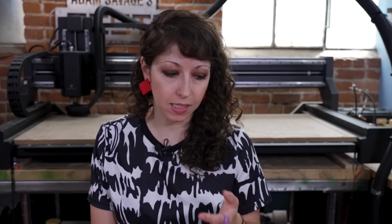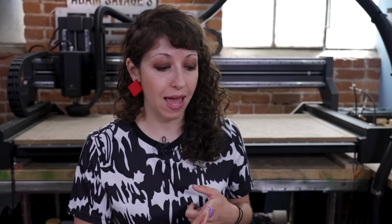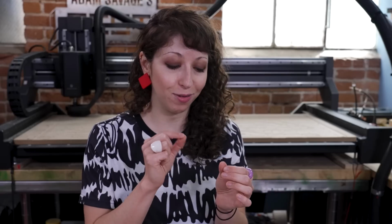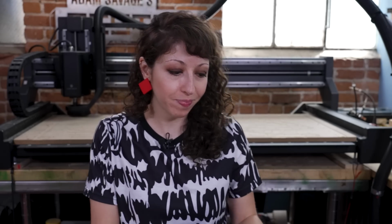It is important to be able to edit your shapes and get the right stroke weights, because we have to consider the finishing process of how we're actually going to be creating this thing. And what I mean by that is when we score the lines with the laser, there is a laser kerf, which is sort of the thickness of the laser beam itself, which is going to burn away some of that masking material. So we have to take that into account. We also don't want to be driving ourselves crazy by peeling off tiny spider web thin lines. So as I go through this, I'm going to be adding a sort of beefy line around the edges of things to make my life easier when I go to actually paint this thing.